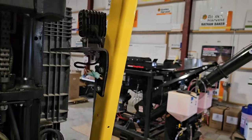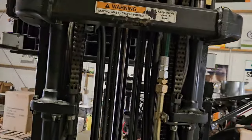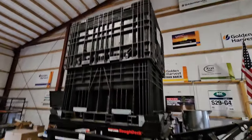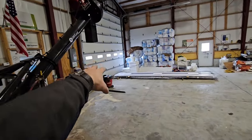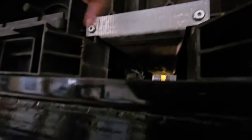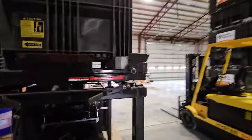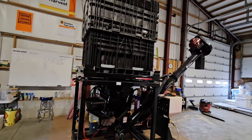We're going to do things a little bit different this year than we have in the past. Essentially I need a box that's going to sit on the treater all the time, so we're getting that box put up here right now. We're going to dump the full boxes into the top of this one and then take the box that we dumped them out of and set it down there so that they get treated back into the same box they came from — so we don't have to worry about switching them later. I went through and made sure the seal around the hole is where it's supposed to be so hopefully we don't have beans spilling out. Sometimes that can happen if the seal gets caught under the forks or boards underneath the box.